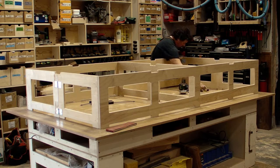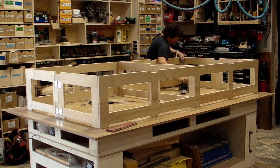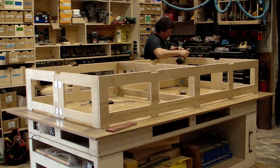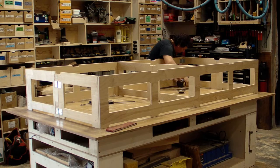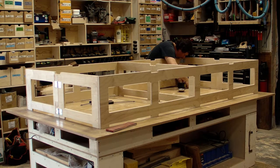I've finished the last corner and clamped it in place. I'd like to draw your attention to the center toggle on this riser — if you notice, all of the hinges are on the side away from the camera, which is badness. As we've reviewed, the hinges have to be on one side for the center seam and then the other face for the corners which attach to the eight-foot length. I really wasn't paying attention at one point. It was the last one I did — I was just thinking I'm almost done, and I didn't do the last flip of that piece and put all the hinges on one side.